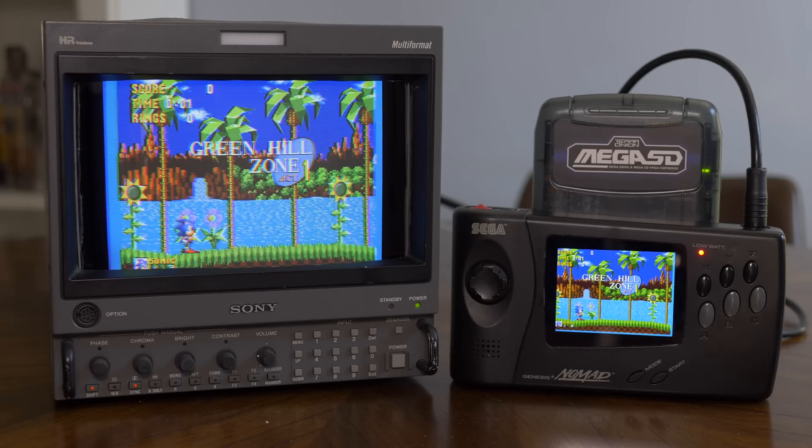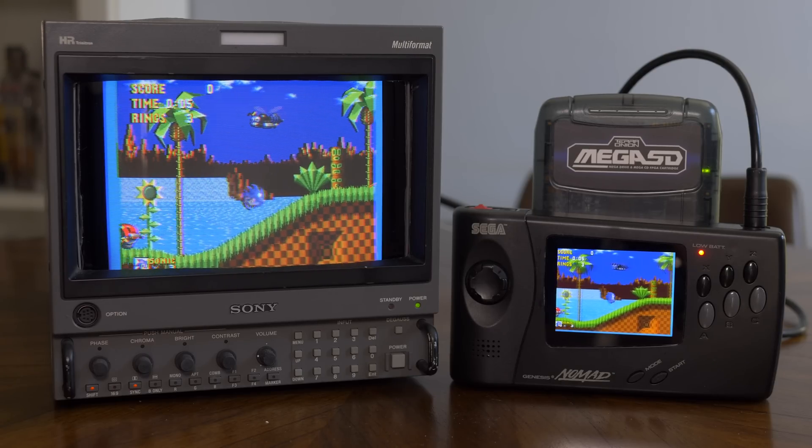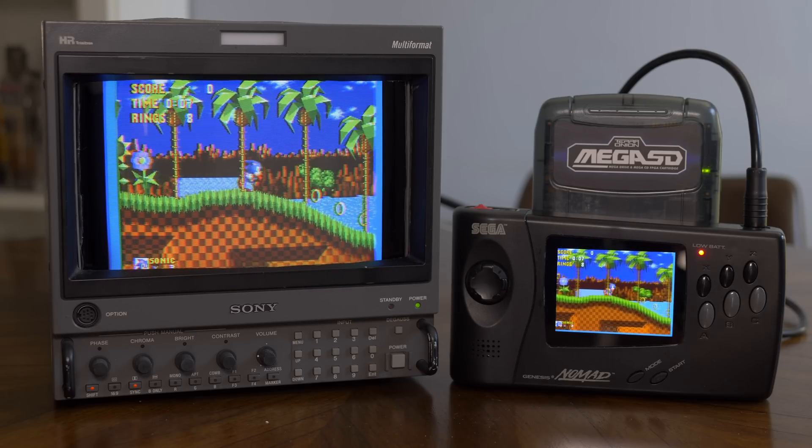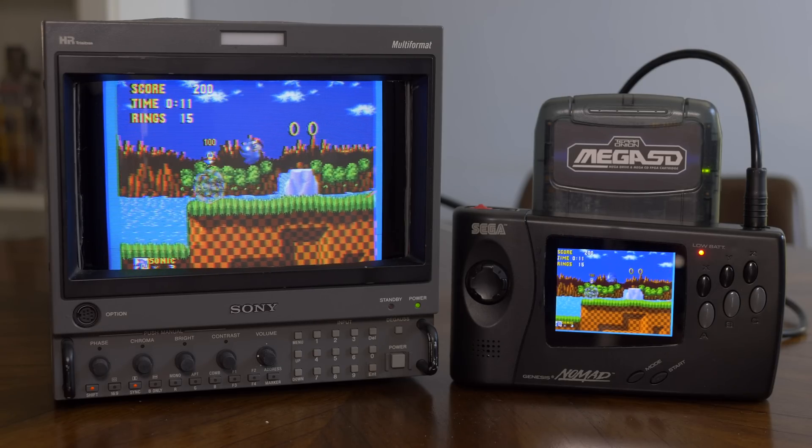Please keep in mind that you'll need to set up the card using the menus the same way you would with all BVMs, by assigning the card and its external sync pin to a channel number, and then setting that to either RGB or component video.